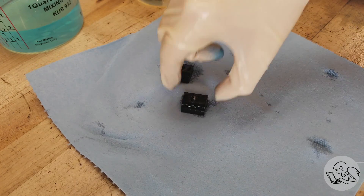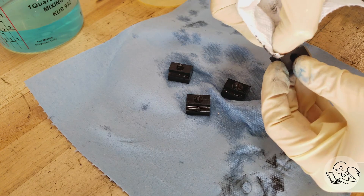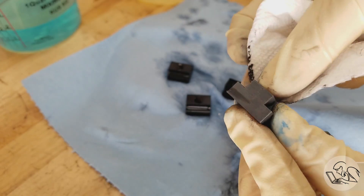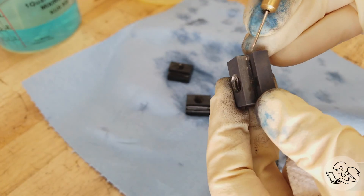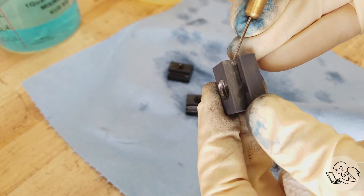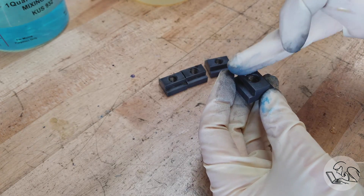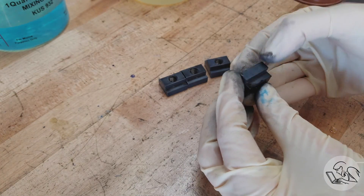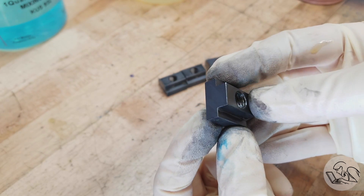Some of the corners and edges take a little more time so leave them in there for 30 seconds. When they first come out they're really black — blacker than the devil's carbon fiber fiddle — but they won't stay that way. Rinse them off to stop the reaction, then once you dry them and give them a little buff, a lot of that initial blackening comes off on the paper towel. They come out a gunmetal blue-gray. It's called cold bluing because at this point you can scuff it up with triple-zero steel wool and darken them again — the more times you do that, the bluer they get. If you have missed spots, that means there was oil there — just clean and redunk. The last step is to give them an oiling; any oil will work.